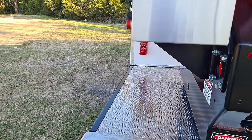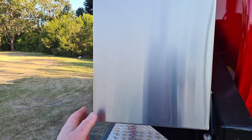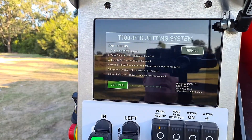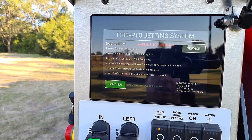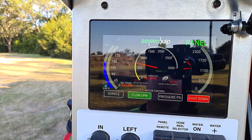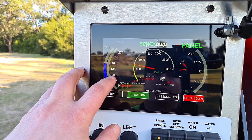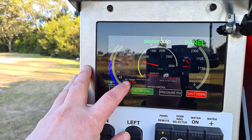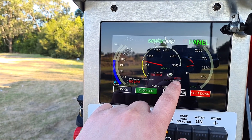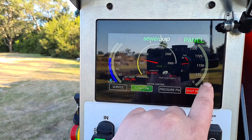Here's the Ejet control system. It gives you your daily checks, and once you've done that you hit continue and that's your main screen. You've got your water level, your water flow in litres per minute, your set point, truck engine RPM, what gear it's in, how many hours till the next service, truck engine temp, and then your pressure — your water jetting pressure.